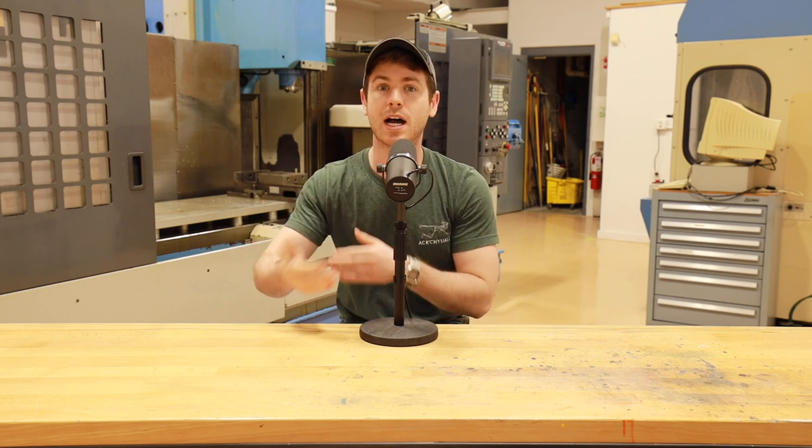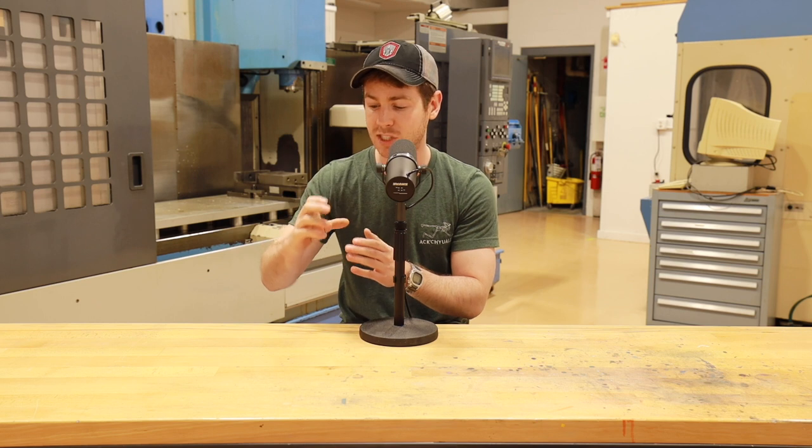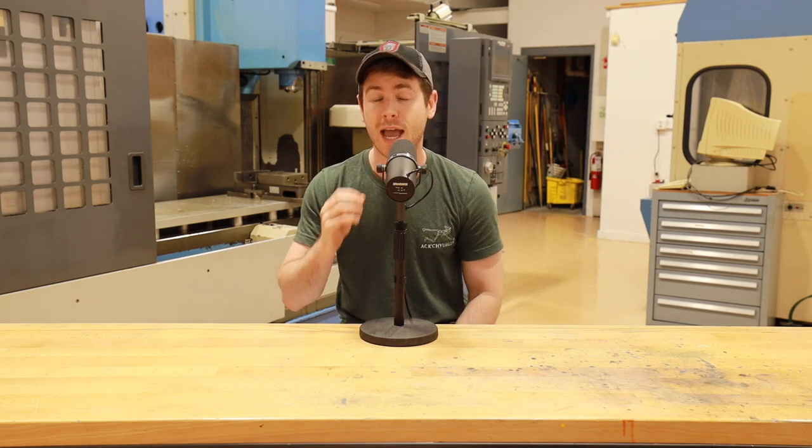The actual locking face on the blade tang of a liner lock faces toward the rear of the knife. Under certain types of pressure — such as from the top, or a wrenching or twisting pressure — the tendency for a liner lock to fail comes from the lock bar disengaging and slipping off of that lock face. Since that lock bar is kind of long and skinny, you can also see bowing in the actual lock bar.